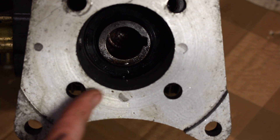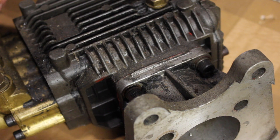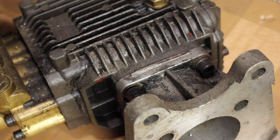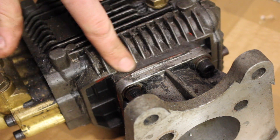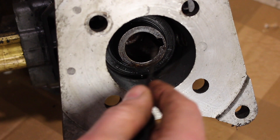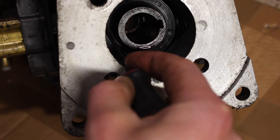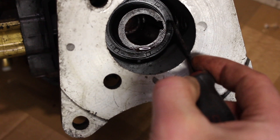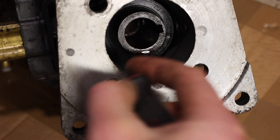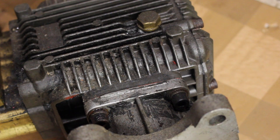When it lost its oil I was able to see it was dripping from the area between the housing and the engine. This here is just an adapter that bolts onto the generic bolt pattern of the Honda engines, and this is where the pressure washer pump starts. In here there's a seal on the one inch shaft, and we can see that seal has popped out — it's just loose there. That's what caused it to lose its oil and then caused the damage inside.